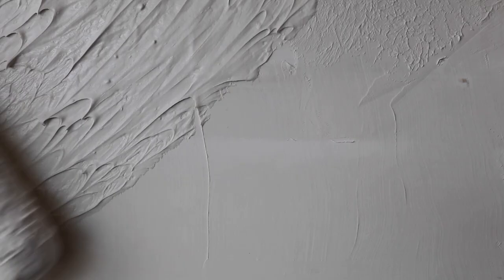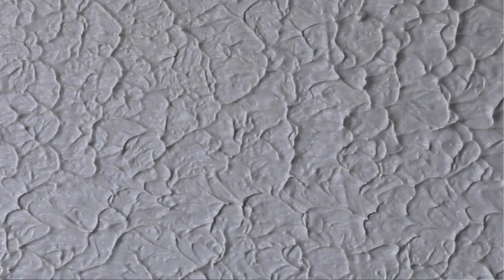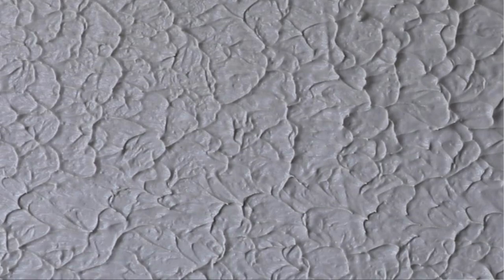And of course there are textures that require a bit more water than a skip trowel texture — for example, a texture applied with a roller if you want a stipple effect. So when it comes to mixing joint compound for your texture, you really have to consider what texture you're going to apply to your ceiling or your wall. This is Leah saying you can do this — see you next time.